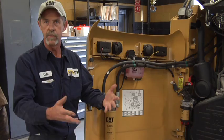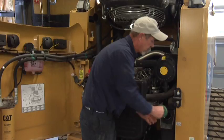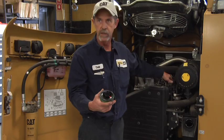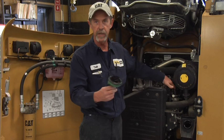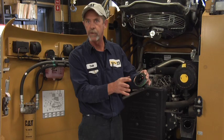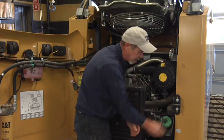On your fuel system it's very important — like I mentioned earlier, it is a vented system. If this cap does not vent, when this machine is running it can only burn so much fuel at one time. If this cap is plugged, it builds pressure in the fuel tank itself. It will cause the machine to run bad — you will get bad fuel efficiency and performance. So it's very crucial. Occasionally you may have to wash this out. You'll see on the bottom there's a little breather down inside. Just take a look at it and clean it up every once in a while, since fuel spills can get it dirty. When you're done, insert it back on, just turn it and lock it down. You'll feel it reset down inside. Lock it — you've got a good running fuel system.